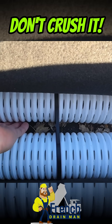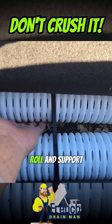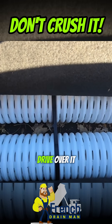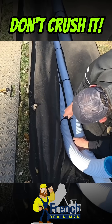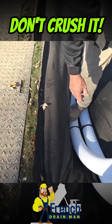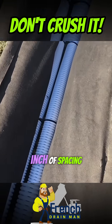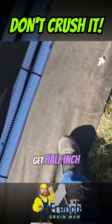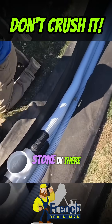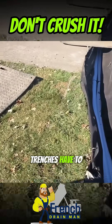When I say under the pipe, we're going to still have the pipe on the fabric — it's just going to roll and support it, giving it some support for when vehicles drive over it. So you can see with the wide clips, you get three quarters of an inch of spacing. That means you can get half-inch stone or three-quarter inch stone in there. You're not going to get one-inch stone in there because we don't want the trenches to have to be any wider.